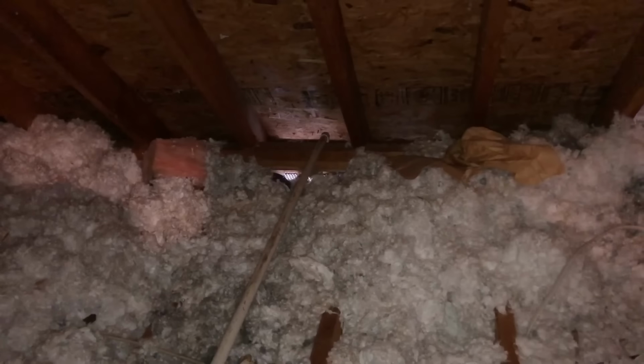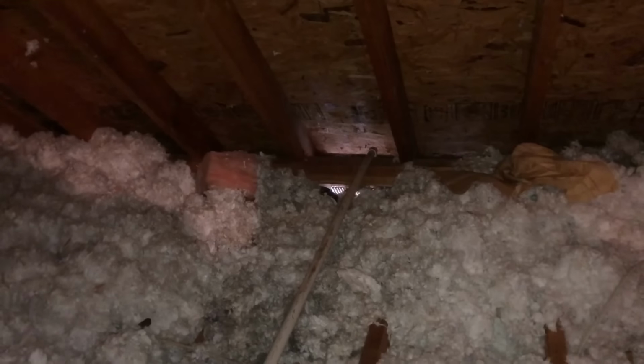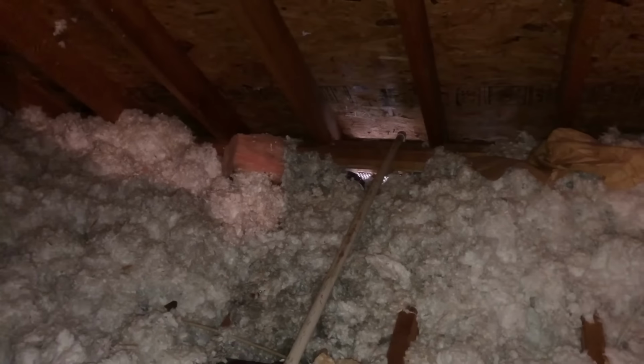And have the protection from the float switch. I like that better anyway. I'm not crazy about the pan being piped off. You can find in some of my other videos where the pan was piped off and the people don't think it's anything wrong, and it's supposed to drip over a front porch or a front door or a back porch somewhere, to where you'll notice the water.